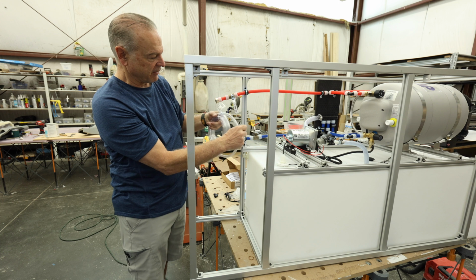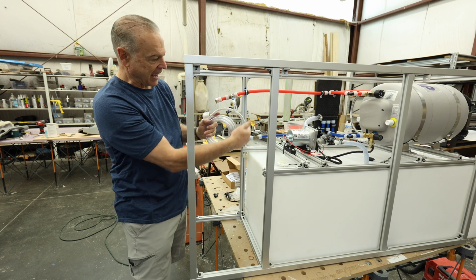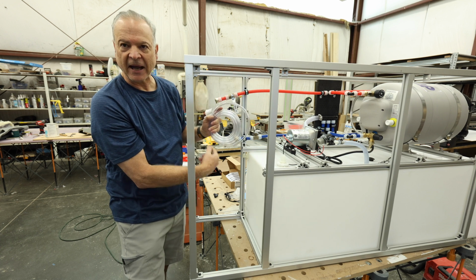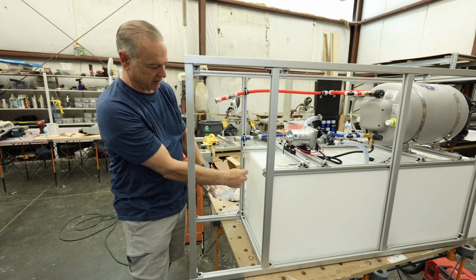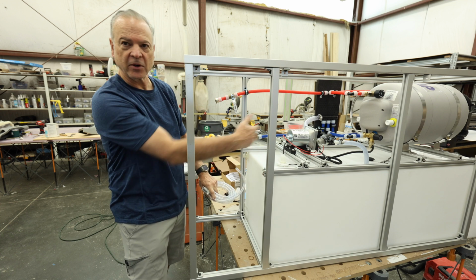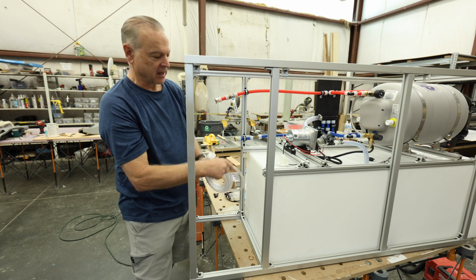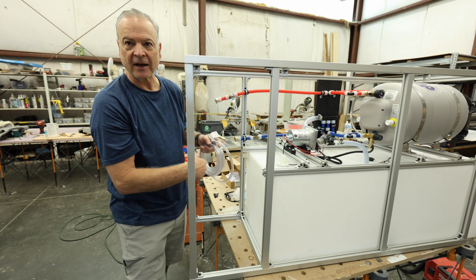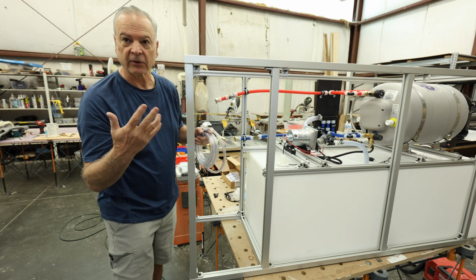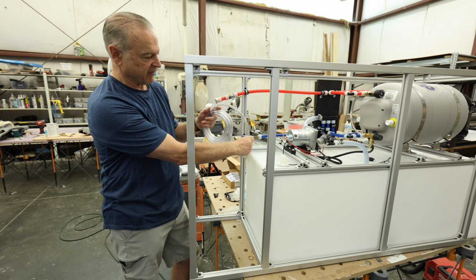And the reason that we do it that way is so that if there is any water sloshing, it has to go up about 12 inches before it comes back down. If you were just to run it down and out the bottom of the van, then every time you accelerate and water comes back, you're going to have water coming out the back. So by just having a little loop in it, you're going to avoid that. Unless you're on a really steep hill or really accelerating hard, you're not going to have water coming out. But that's how we do the van.